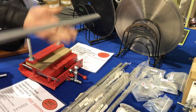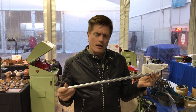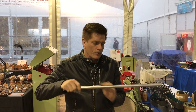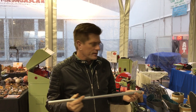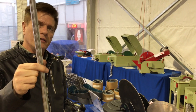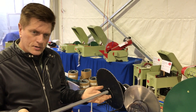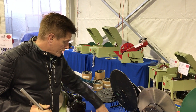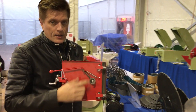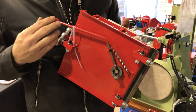We sell rails. The old Lortone rails are like cheap gummy steel — they would wear out, so everybody would be turning their rail because it would get worn. That didn't make sense, so on our Hightones we put a hard steel rail in. We're now selling those rails so you can take your Panther or your LS-12 and put hard steel rails in, drop a new carriage. The carriage comes with a vise and also with the feed nut, so it's basically everything you need to go.